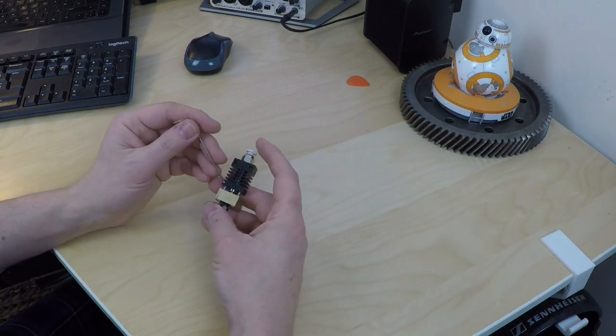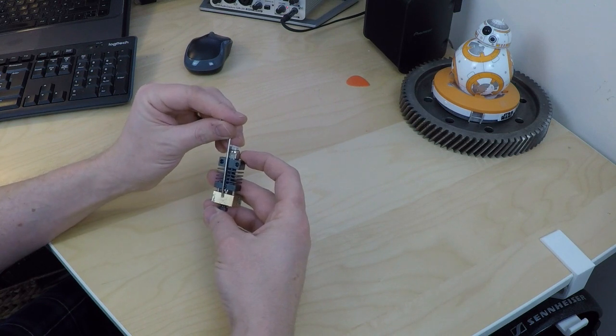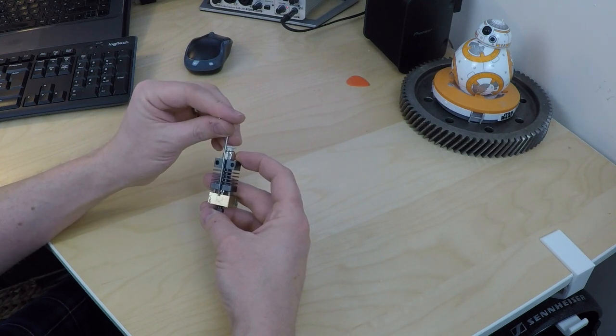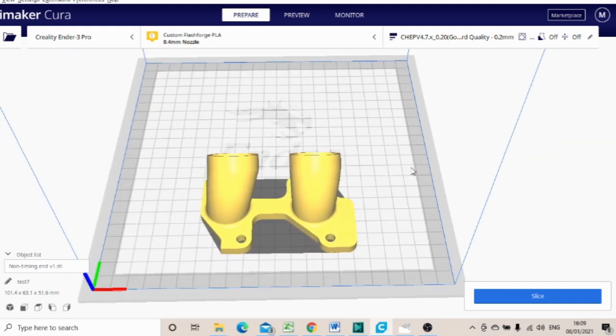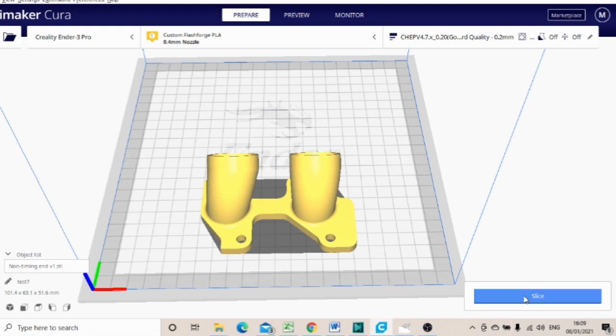Because every time I pull that filament up four or five mil, I'm going from the hot area where it's melted to the cold area — and that's going to give me a real clogging problem straight away, because as soon as I pull the molten filament up it's going to cool and then I won't be able to get past it. So literally all I did: I took my standard Cura profile — one of the Chuck Hellebuyck ones — at 25 millimetres per second retraction speed and just put it down to one mil. Why one mil? Because it's an extreme value; you can't go much smaller than that, and it should prove the point — will it help or won't it? Only one way to find out.